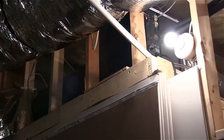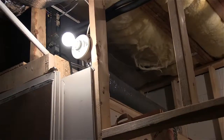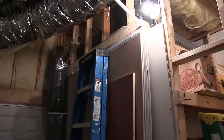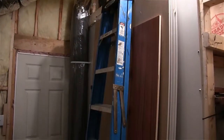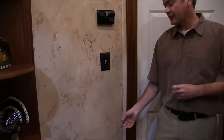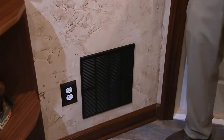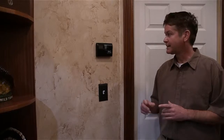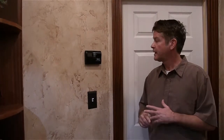The thermostat is on the wall here — chose to keep it inside the cellar. This is standard with any Wine Guardian product. You do have the option of an interface control thermostat, which can be installed anywhere in the home, typically right outside the cellar but up to 50 feet away. The return is below the thermostat near the entry door, and the supply is overhead on the back left. The Wine Guardian thermostat comes standard with the system, and you can also get a remote interface controller as an option, installable up to 50 feet away — or further with an additional cord.